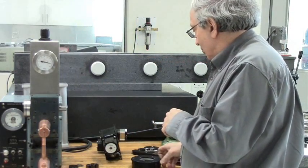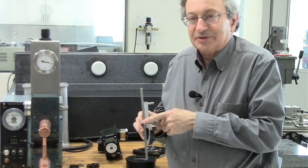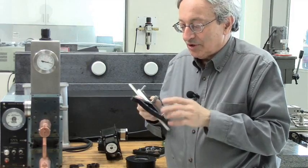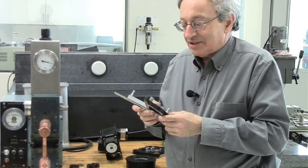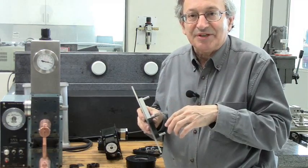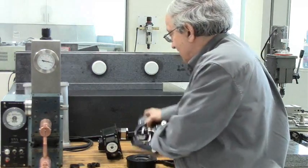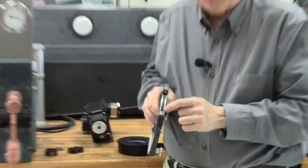Another thing you do on a water jet is minimize machining. If you need parts that have to be more accurate than the water jet's accuracy, you water jet the whole part, then touch it up on a machine. The way to do it is: water jet it, paint it, clamp it, and after painting touch up the surfaces. This is much faster than the normal way of masking precision surfaces and then painting, because the paint is tough enough to clamp in a vice and do the machining. Here's another example where 95% is done on the water jet and just the rim is machined afterwards.